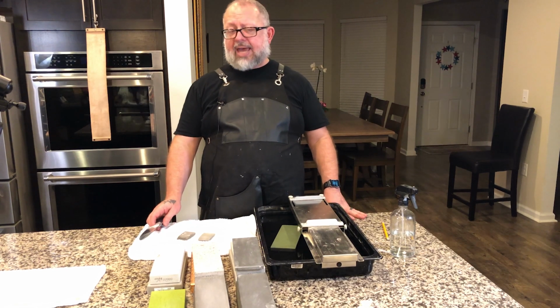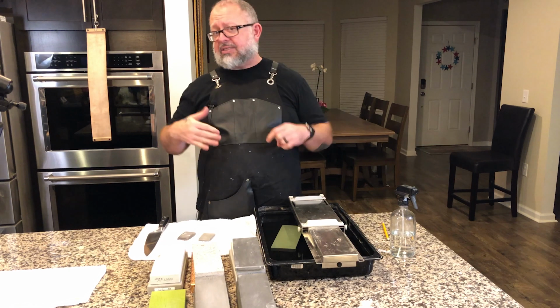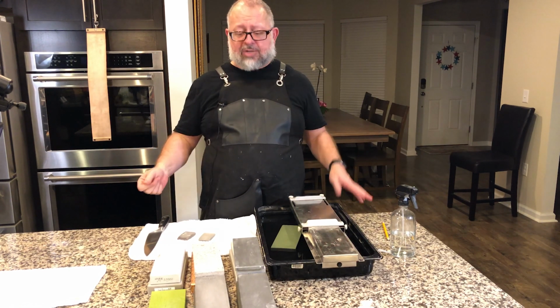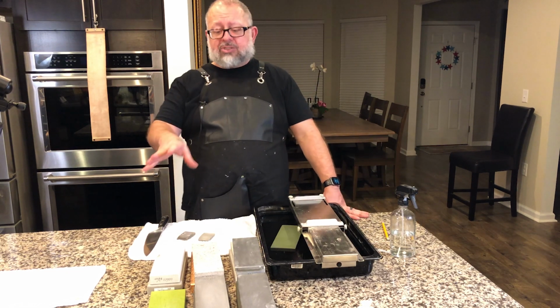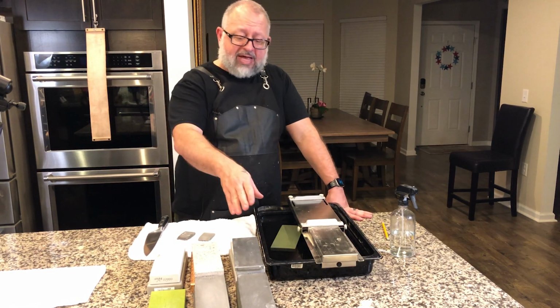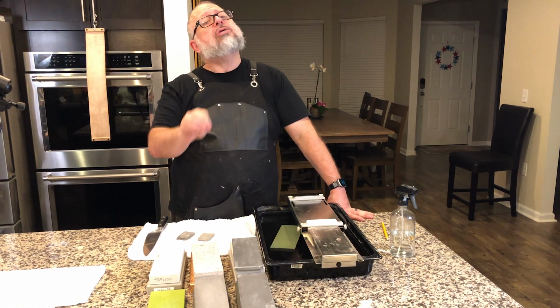So that actually raises a question right in the middle of this video. Again, we're organic. This is happening. We're having to make decisions right now. So I went ahead and grabbed all the Morihei sharpening stones. I got out the 500, which I won't need today. I got out the 1000. That's normally where you start.